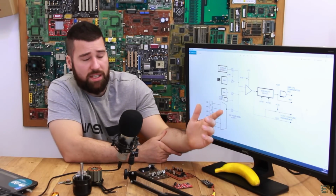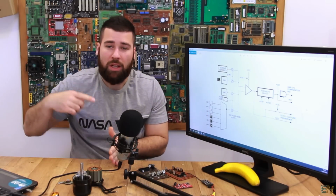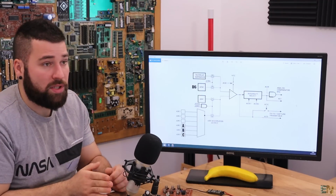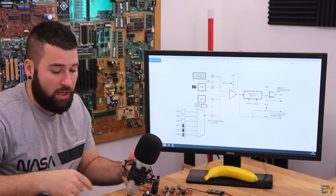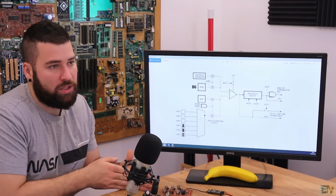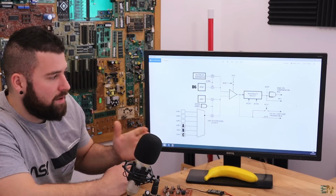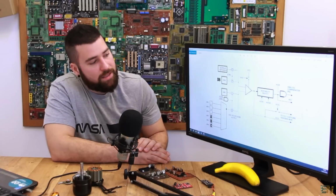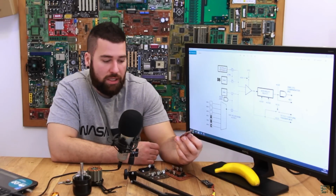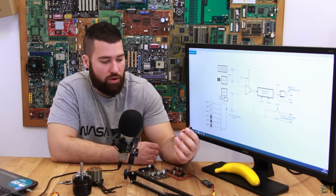So using interruptions is very easy to control the code, because while you are making the full loop of your code, when we detect an interruption, we pause that part of the code, we make the changes in the interruption, and then we keep going with the loop. In this way you can always detect the change. You can't skip it with the interruptions. That's the good part. So that's how I use the internal comparator from my board instead of using external comparators.